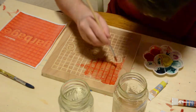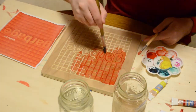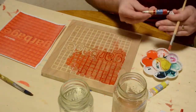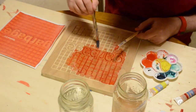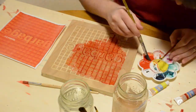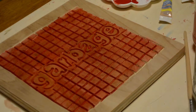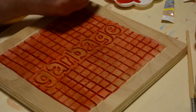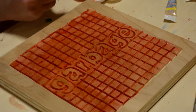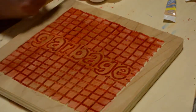After getting the watercolor on and letting it dry, I used a couple of coats of spray-on polyurethane to lock in the colors. Here are the results: the router bit with the 60-degree tip worked great for details — I'd absolutely use that again. The router is okay but not great, so I'll keep it as a backup. The nicer plywood carved really well too. And the bonus test — the watercolor — worked out really well, though finding the right brush to get into the depths of the details was a bit clunky.